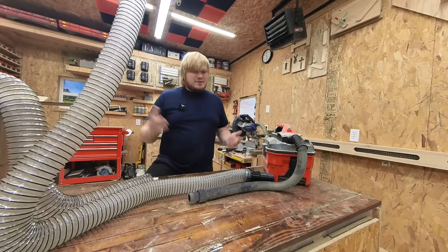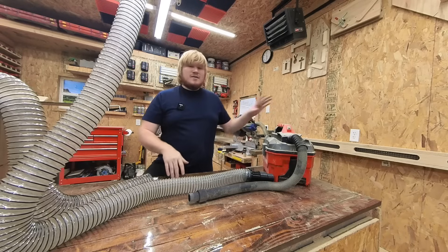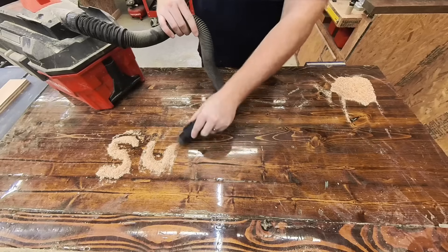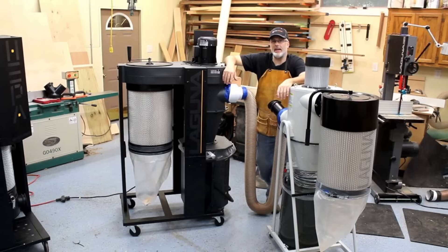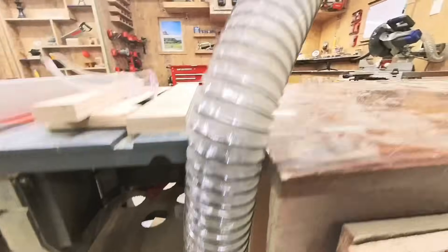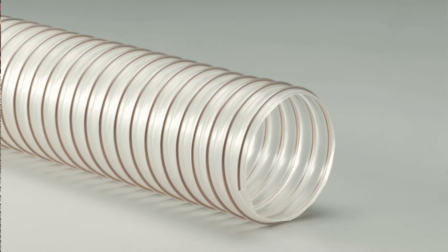The next question on everybody's mind: does size matter — both length and diameter? Vacuum hoses come in all sorts of lengths and sizes. Portable vacuums have as thin as a one-inch hose, while larger dust collection systems can support up to a six-inch hose. Smaller vacuums have thin stretchy hoses because their motors are small and a thin hose at its shortest gives the most suction. Larger dust collection systems jump to four or six-inch hoses because they have larger motors and an easier time moving smaller particles — but again, they struggle picking up wood chips, nails, or other debris. The longer a hose on a dust extractor, the more air friction it incurs. Portable dust extractor hoses aren't perfectly smooth like tubes running through a shop — those ridges that strengthen the hose create friction as air passes over them, reducing performance the longer the hose.